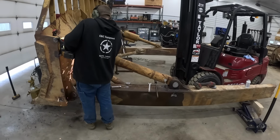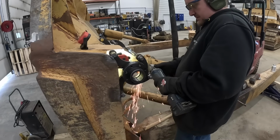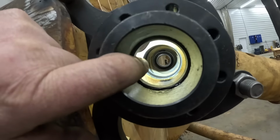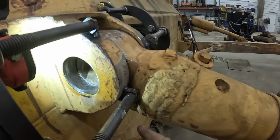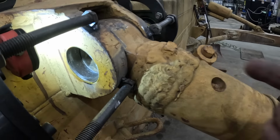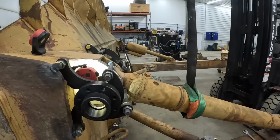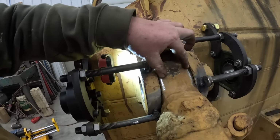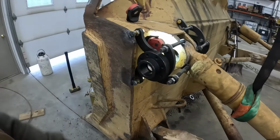We almost made it. So, all of you guys can see, we lack just like a 3/32 of an inch of going forward. And this bolt we put on is hitting, so Kevin's cutting the head off a little bit. We've got a floor jack under there picking that up, and turn that pushes that forward. We get that lined up. Tucker's gonna tack this thing in here, kind of like we just did here, and hold it. Then we're gonna line bore right through that.